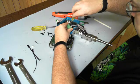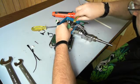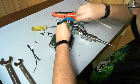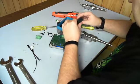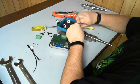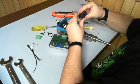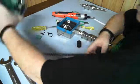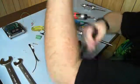Use a small flat tip screwdriver to disconnect the wires and place that to the side. Pull the wires through the ferrites, then place the meter out of the way. You should be using an anti-static mat and ground it when touching the PC board.